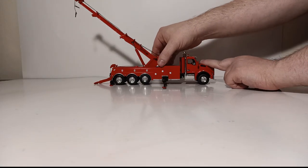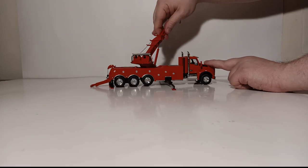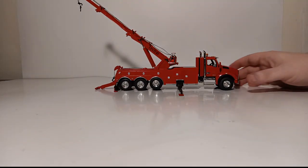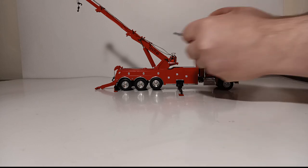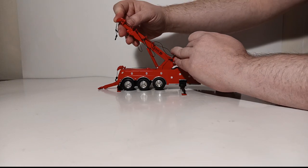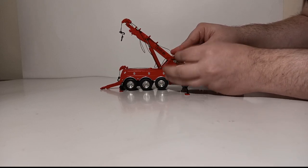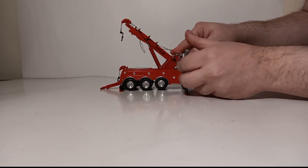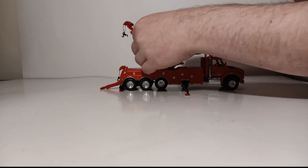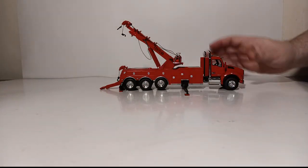Additionally, you can spin this 360 degrees because it is a rotator after all. Now we've made our recovery — let's turn things back the other way. Put the boom down a little more, extend our boom down, and now we've got to wind in our winch lines. Spin the key the other way — it's now coming in. Give yourself just a little bit of slack so it doesn't get all tightly wound. That's that side done.